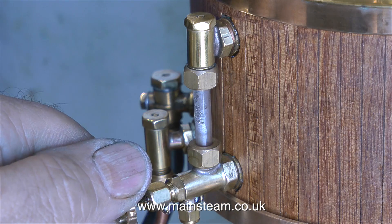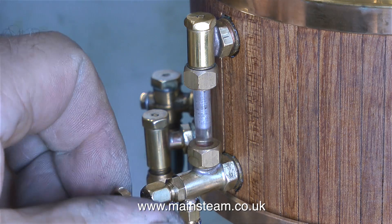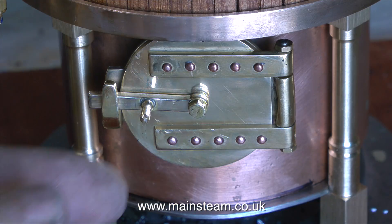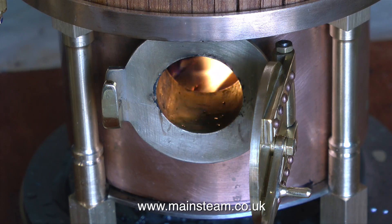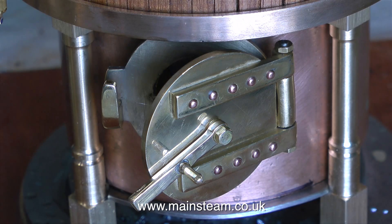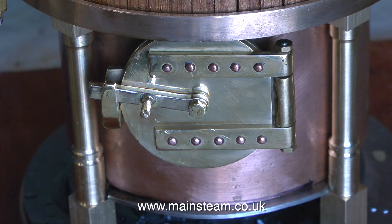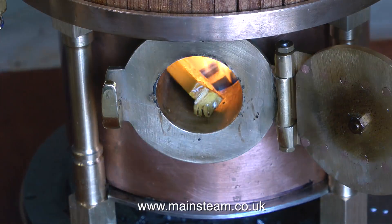I'll just check the water level. This is the problem — when the blower is using steam, the water level starts to drop. Once the water level gets really low, you have to put cold water in, and this drops the pressure, which means the blower becomes ineffective and the fire starts to go out. It's a cycle of events that is very common for both beginners and experienced people when firing model steam boilers, particularly the boilers found in model steam locomotives.